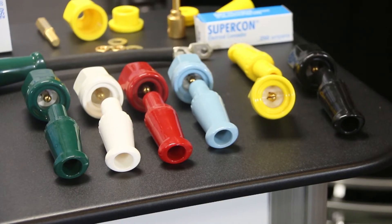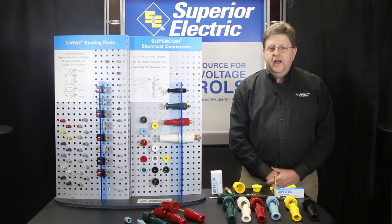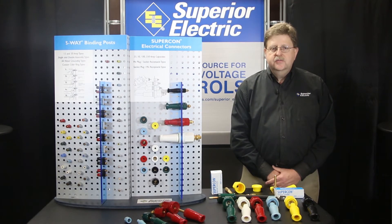The six colors — black, red, green, blue, white, and yellow — permit a wide latitude in patch cord distribution layouts. These colors support the National Electric Code circuit connections for single and three-phase electrical service configurations.